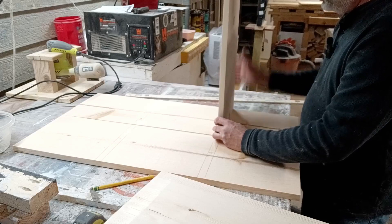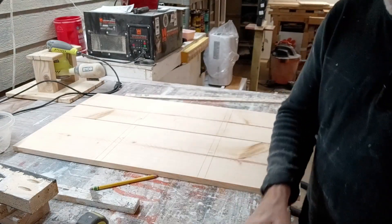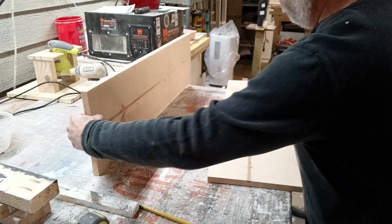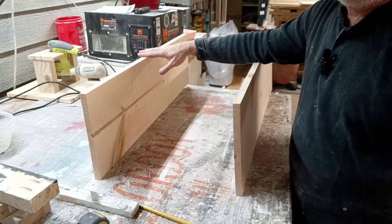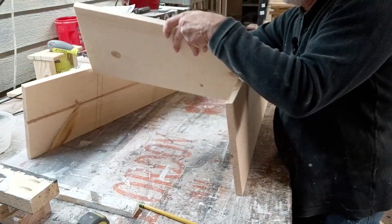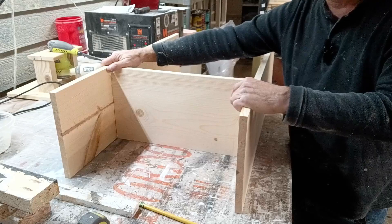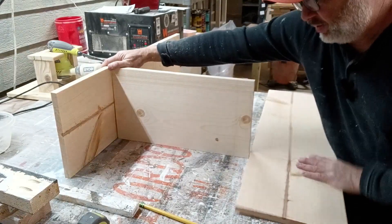I had to rip these down as well because the depth was a little bit more than needed. I'll put pocket hole screws in these and attach them to the sides. Since I've got these sides marked already, I'll turn them to face each other. With the lines marked on where I want to put the shelving, I'll do the pocket holes in them, then line them up to go exactly where they need to go. That way you don't have to worry about getting them on level, because as long as this is flush across the top, the shelves are going to be flush and level all the way across. That's the way I learned how to do that part.